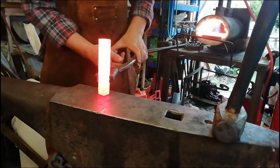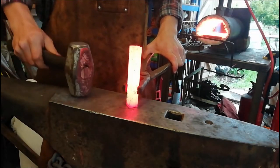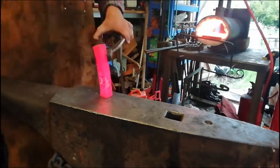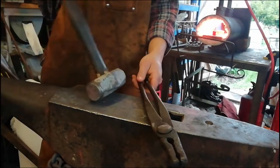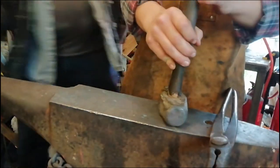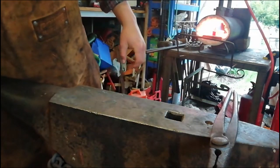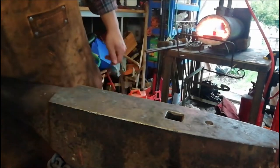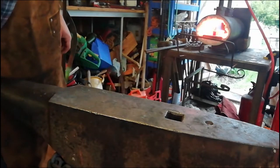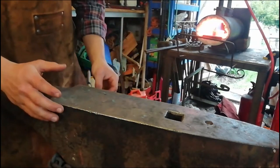So, first thing we're going to do is take our 3/4 inch square block and start upsetting it. Now for those who don't know what upsetting is, basically taking a long, thinner piece of metal and compressing it down so it's shorter and wider. Some of you may remember if you've watched my snakehead hook video. If you want to see, it's either in the description or top right corner. But it's just taking a long thin piece, compressing it down, making it wider.